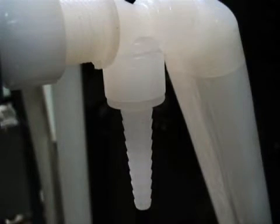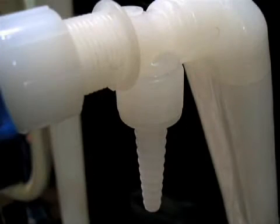The precise needle valve outlet on the AquaTap faucet allows users to control the flow from a trickle to full flow with just a couple of turns. All wetted parts are high-purity PVDF or PFA, and the positive shutoff needle and PTFE seal will ensure years of problem-free service. Should service ever be required, a valve stem or seat can be replaced in a matter of minutes.